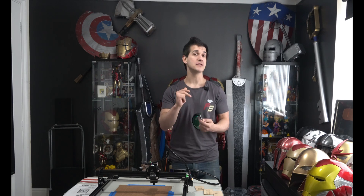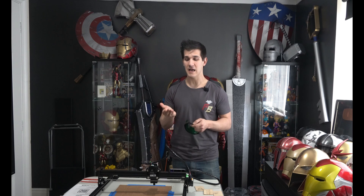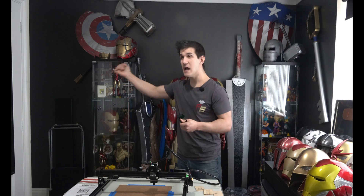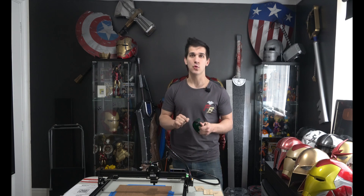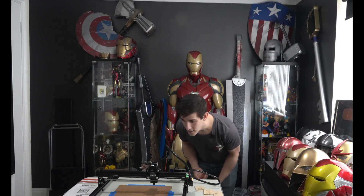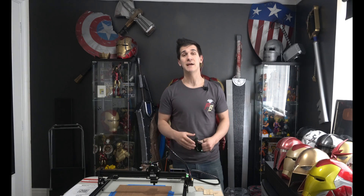It's giving off fumes — it's burning and melting stuff. Cardboard, paper, plastic — a lot of different things react weird when you hit them with this high a temperature, and you never know the fumes coming out. Be careful. Ventilated area. If you have it in a workshop or somewhere in your home, maybe have some type of safety system, a sign on the outside of the door so people in your household know there's a laser in use and don't just walk in and start staring at it. I really want you guys to be safe about this — this could be a very dangerous machine.